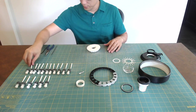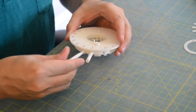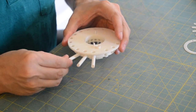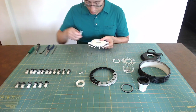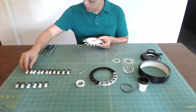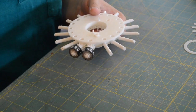To assemble the carriage, begin with the carriage casting. The results and turns counter dial axles are fit into place. These may be a loose or slightly tight fit. When the results and turns counter dials are fit to the axles, make sure to keep the dial and the axle paired together. Now add the results and turns counter dials to the axles, keeping the original pairings.